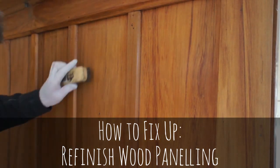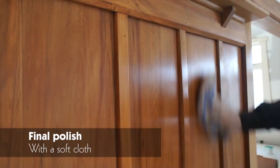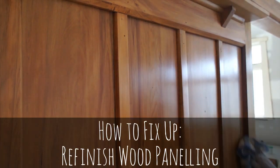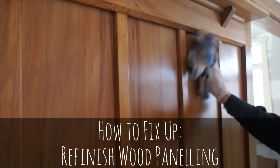After a few minutes the wax will start to harden. Use a shoe brush just to buff up the finish and spread it out, evening out any lumps or bits left behind. Just do a panel for about 5 minutes, then buff it up. Once you've finished — maybe a little later, any time — buff up the whole surface with a clean cloth to get the final sheen.